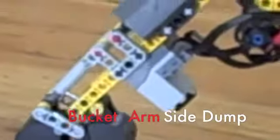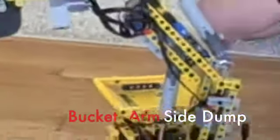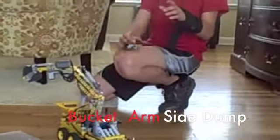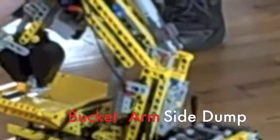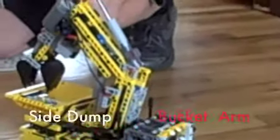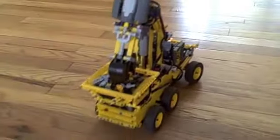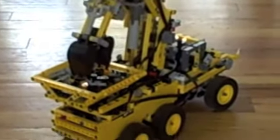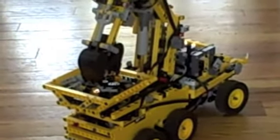It is completely remote control. The linear actuators allow me to convert the motor's circular motion into linear motion, allowing me to move levers in the arm. It takes many scoops to fill the giant side dump. Now you will see the side dump in action — underneath the side dump there are gears and a linear actuator to make the side dump move upward.